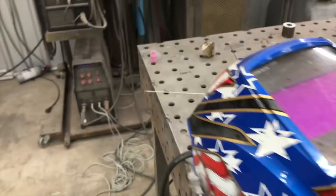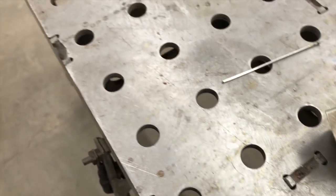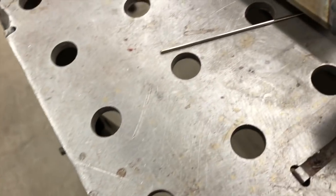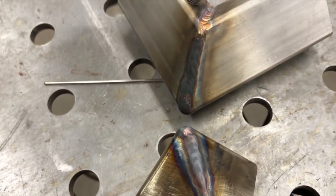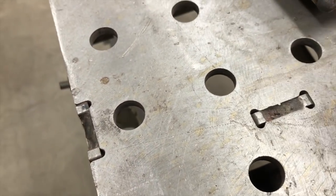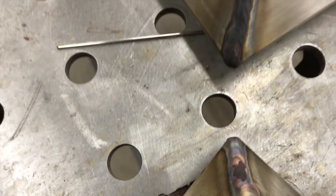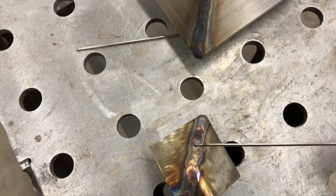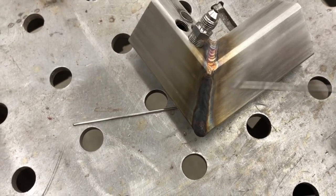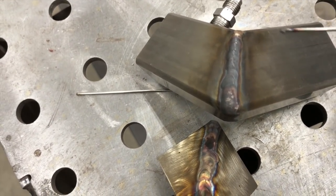Kind of a little bit of an awkward piece to weld and I had a couple of touchdowns in some areas, and then of course the black smudges from my glove got on there. Both of these are outside joints — that gives you a look — and then let's look at the top part. That's a pretty good view comparison there. That right there is where I touched it with my glove and grabbed some oils off of it. But in general, if you look at that, it looks like it's less corroded or exposed where this is all dark looking. See how that's sort of just hazed over and dark looking.